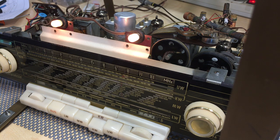I've got a new internet extender. I haven't tested the noise on that thing yet, but I'm sure it's sort of helped. And, you know, with everything else on here, it doesn't help. But as you can see on shortwave, I certainly noticed the difference and the improvement. And that's all got to do with that improvement we had there, which went from, as a reference, 800 millivolts RMS with a 12 dB attenuation there, and it went to 1 volt, 1.05 or something. So we did get an improvement. And that part is done.